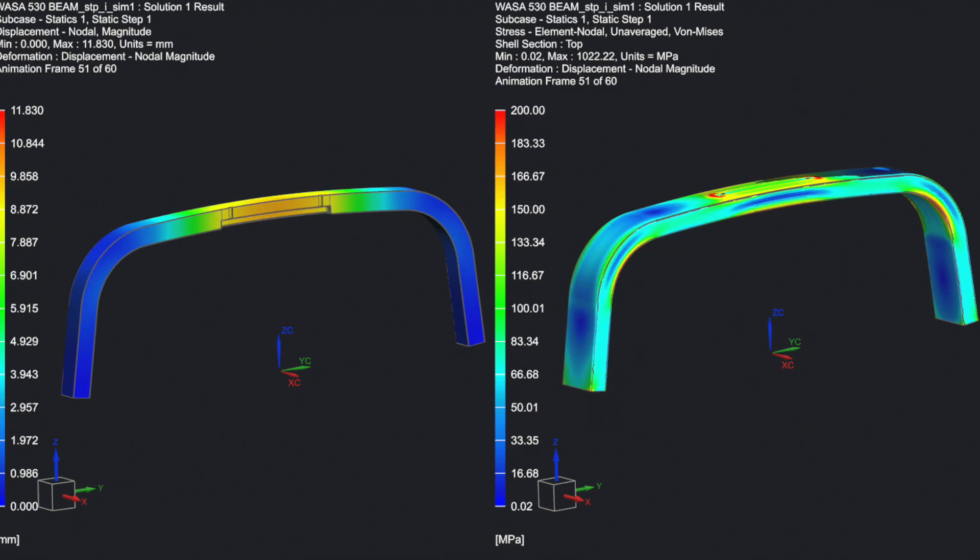So we will have quite a lot of safety margin built into the design. We have a first idea of how the cross-section of the main sheet beam should look, and we will do FEM analysis to see where the weak spots are. The beam will be incorporated with the doghouse, but the idea is that the beam alone should take the load for the main sheets - the beam and doghouse are glued together but structurally separated. Visually it would look like one part, but structurally they are separated. We are leaning quite heavily towards building the actual beam in carbon fiber laminate sandwich structure, and the rest of the doghouse will be a GFRP sandwich structure.